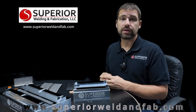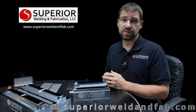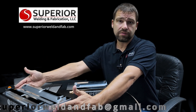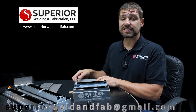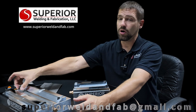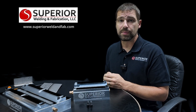Another thing to talk about is recommended gas flows for your weld test fixtures. I've had customers give me feedback in different ranges, but for the most part 10 CFH works pretty good on the small fixture, and 10 to 20 CFH will work on the big ones. That's going to be dependent on the size of the coupon you're welding and how much you have open on your screens. Those are general guidelines — from 10 to 20 CFH works really well for your argon purge.